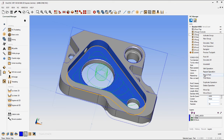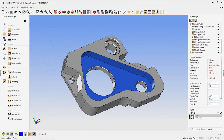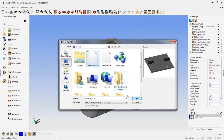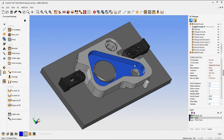You can move operations up and down and even re-pick geometry if you've selected the wrong geometry. What about fixtures? If you want to, you can import fixtures by using Merge. When you use Merge File, it brings the extra geometry in without deleting your existing geometry. Merge is fantastic for bringing in tooling and fixturing.